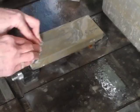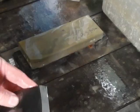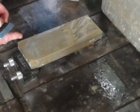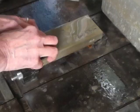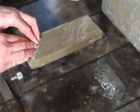As you get the black swarf going, just maintain — keep looking at your bevels, make sure you have the jigane and the hagane contrasting with each other, and look at the edge. Eventually we're going to go to just clear water on this Asagi, and depending on your skill you should be able to do some final passes with clear water only. You want to really focus in on the edge at this stage and get that real close relationship between the stone and the steel.